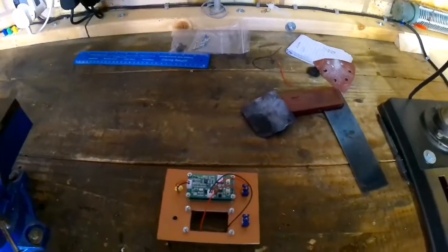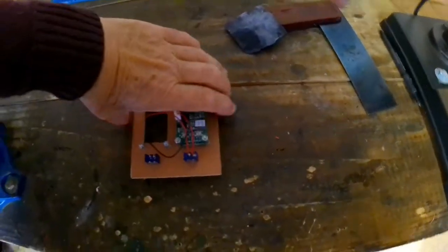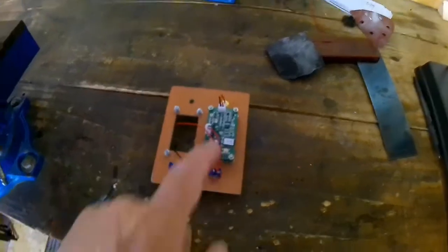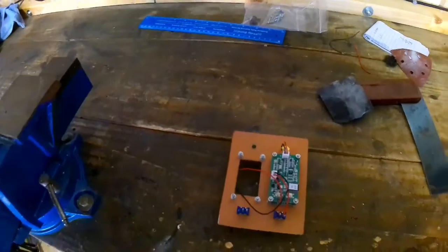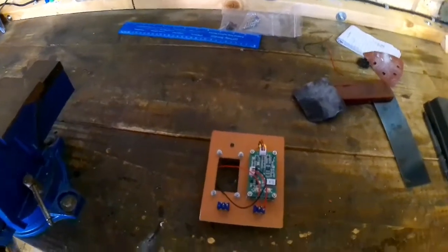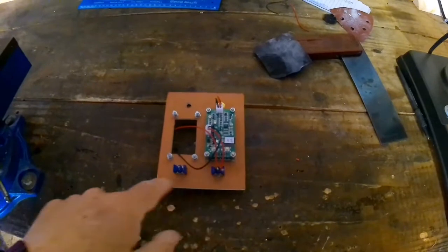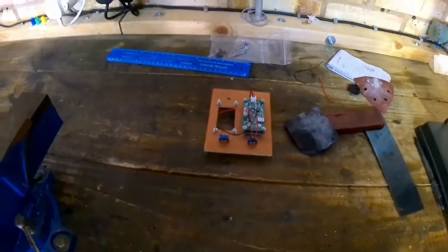So I've got a 9 volt voltage regulator to fit in here somehow, and what I'm thinking of doing is having a piece of angled metal along here and have the regulator standing up. Now, these modules draw less than 100 milliamp, so it doesn't need a real big heatsink or anything, but I'm going to use a 1 amp regulator, a 7809, which is, I think, 12 to 20 in, or something like a 9 volt out up to 1.5 amps. I think it is anyway, so that's the idea. We'll make an L plate out of aluminium. Going to use the on-off switches to hold the aluminium in, and then I'll start on the wiring actually, because I really need to get on with this project.